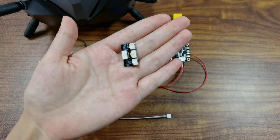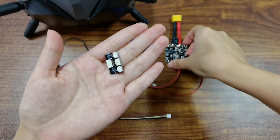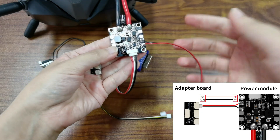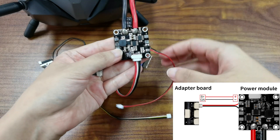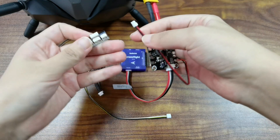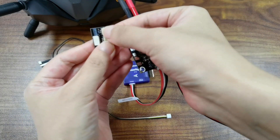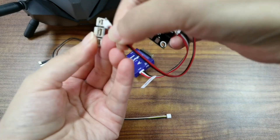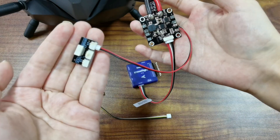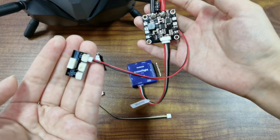The adapter board comes with several cables. One cable is soldered on the power module. Here it is. And the other end of the cable is connected to B-plus and the GND of the board. Here it is. The cable is to supply power to the FPV system.